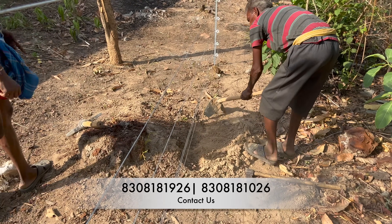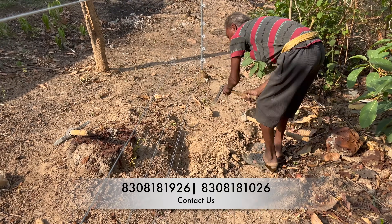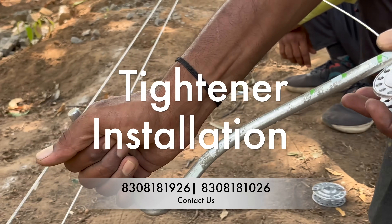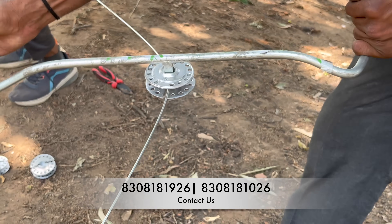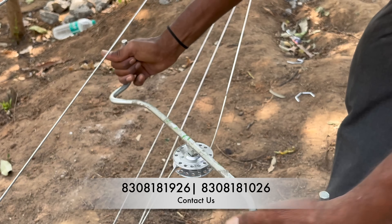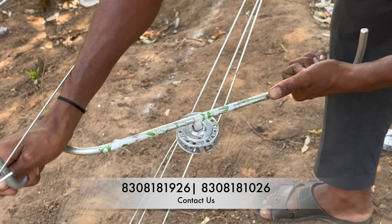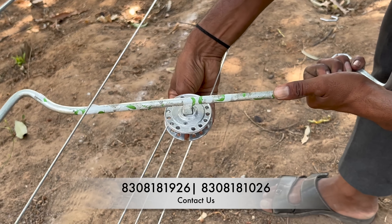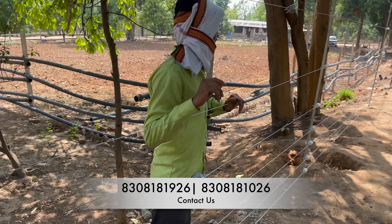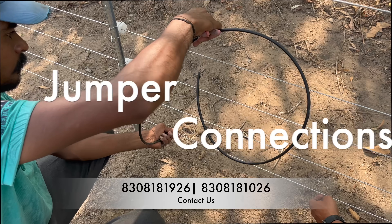You need to make sure that the land does not touch the bottom wire, because that drops the current and makes the fence useless. You will need to provide your own labor for this job. After that, the most important thing is tightening of the wire, because after tightening the fence looks very good. If you have four layers of fence and four corners, you will require around 16 tighteners. If you put your data into our quotation system it will calculate this for you.